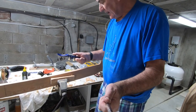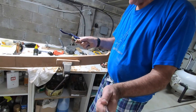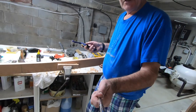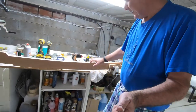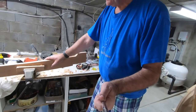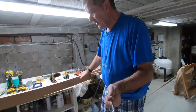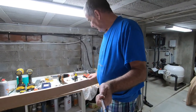Once you set the blade at the right height, you can make tiny adjustments on those screws and pull the blade out if it's taken off too much, or put it back in if you want more. You get the feel for it eventually. In about ten minutes I've brought these back down to the line and when I look down there I get a nice smooth curve — which is taken for granted in a lot of woodworking shops. But if you don't have the skill, you've got to learn them. And I'm learning them. Really useful tools — you've got to have the tools to do this job.